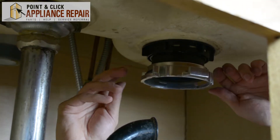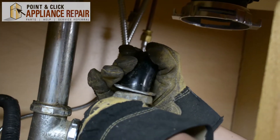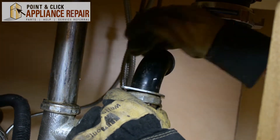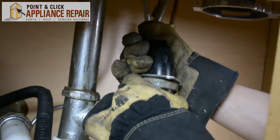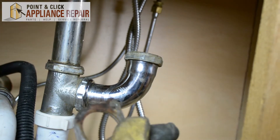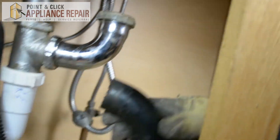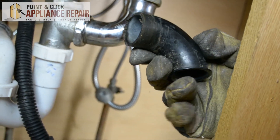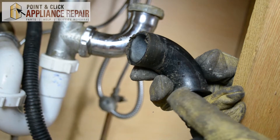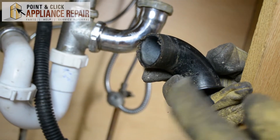Now that we've got everything ready to put the disposal on, I'm going to pull out this old pipe here. You can take a look at it — if the pipe is good enough you can keep it, and that way it will save you a little bit of work not having to cut a new one. We've got that old piece right there. I don't really want to use that on our brand new disposal. With this piece, all we really have to do is wash it off. You can also use this as a template to cut your new one — if it's pretty worn out or beat up, grab your new one, measure it with that, draw a line, and cut it where you need to.